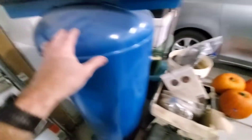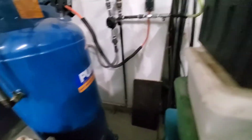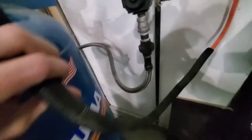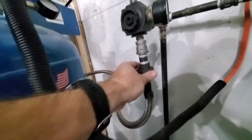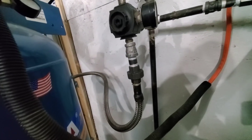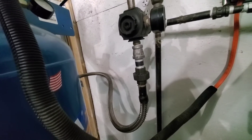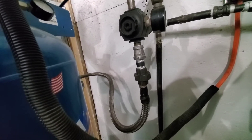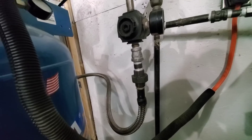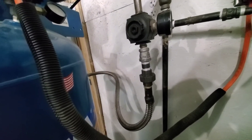So if we walk around here just a little bit — we've got that stainless steel hose coming out of here, and then we go into a union. I use these unions all over, and they make fitting stuff up and adjustments a lot easier. They're also a potential leak source, so there are good and bad things about it, but I choose to use a couple of them.